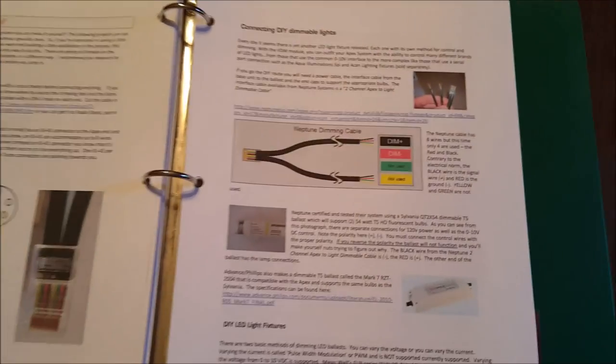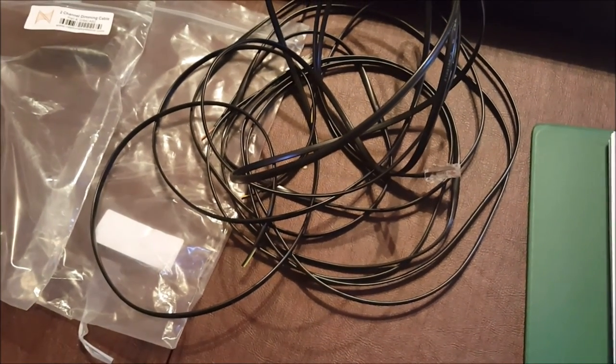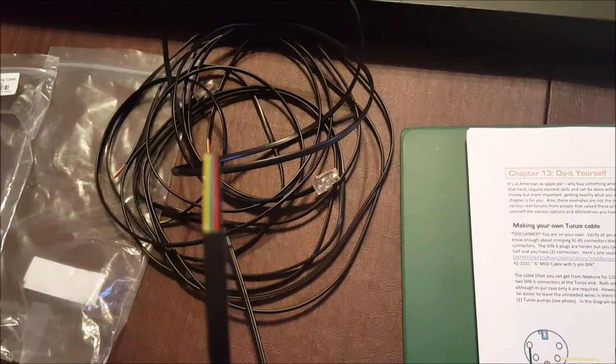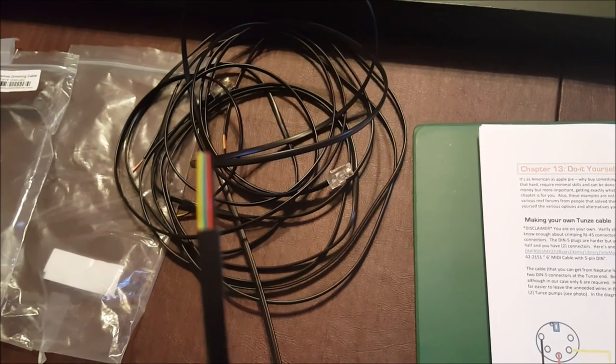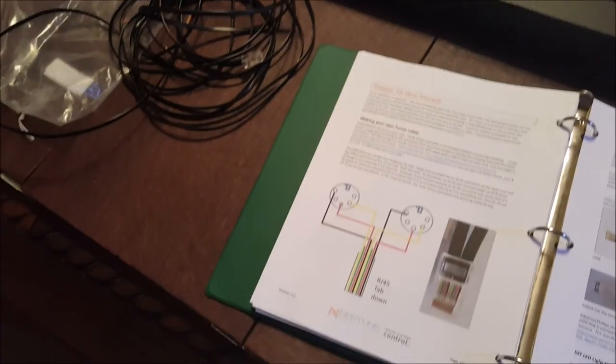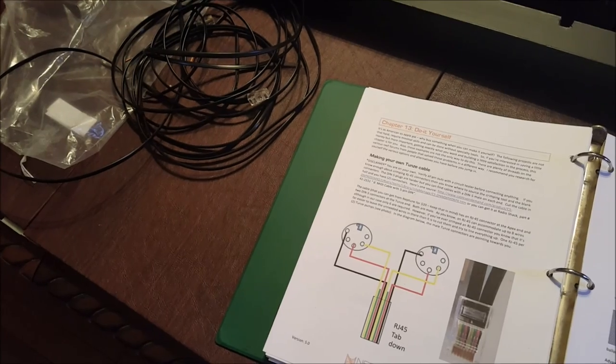You will need some wires. And for this particular one, we've got the actual Apex RJ45 jacks with probably about 6 feet of cable. And then the ends of the cable are pre-stripped. And we're going to be using the red and the black cables only. The other four cables are not used at this point. If you're doing a Reef Keeper, their plug has a Molex 2-pin connector on one end, and then of course black and white on the other.